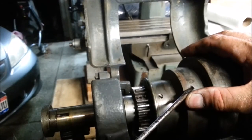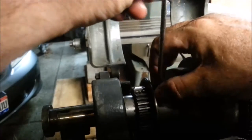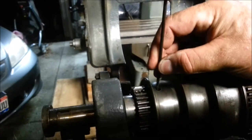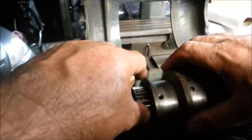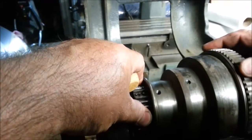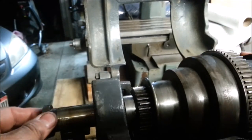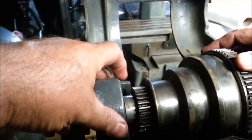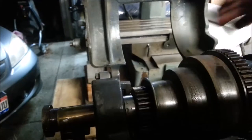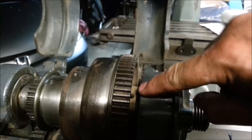Just to investigate this properly: this is marked oil because there's usually a bearing in here — when you're using the back gears, this spins on the shaft. This one here is not marked oil. There may be a set screw under this. I'll get my beloved ice pick out. Nope, I don't feel anything. I can see the shaft moving in there. This is loose. This collar here doesn't seem to have anything holding it. Let me put my oil plug back in before it's lost.